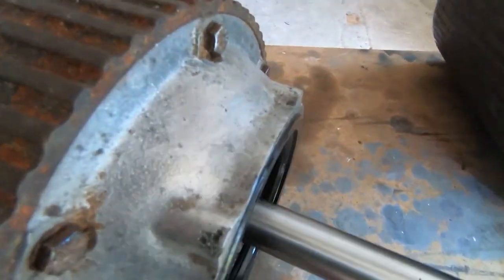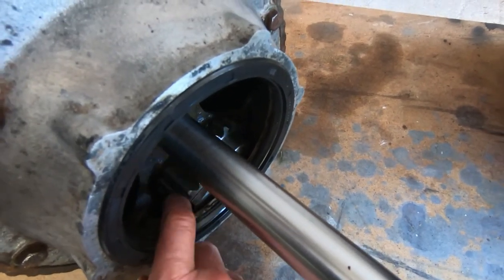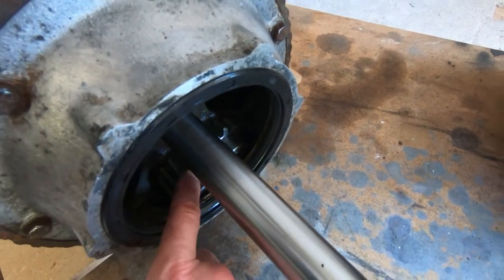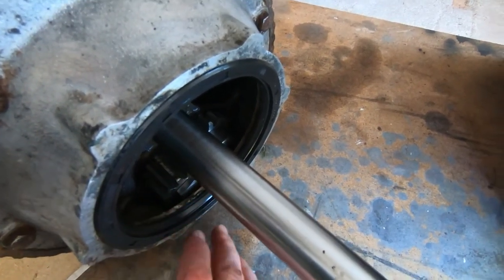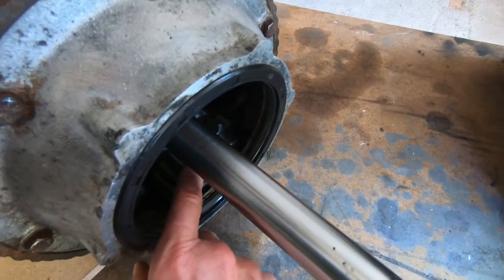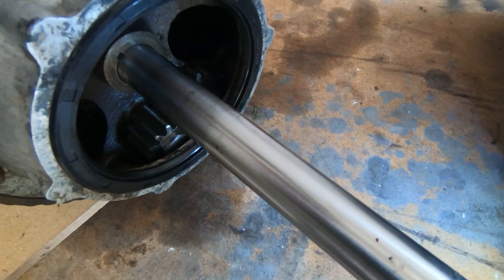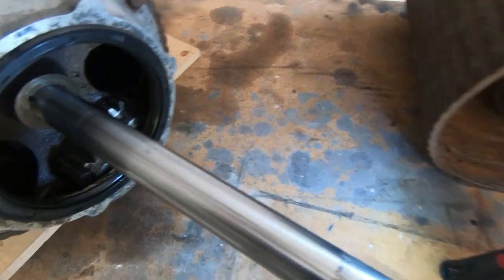So that works fine. I had feared that somebody had welded this up to make the machine go in a straight line. If they had a large football pitch, for example, they might want to do that. Not something I do, but I have seen it done. This was absolutely full of sludge. I assume that no one's ever put oil in this. There was no oil in it at all as such. It was just thick black sludge. So I've cleaned all that out. This now slides freely in the centre section, so that's fine. But that's how it should slide in the drums.